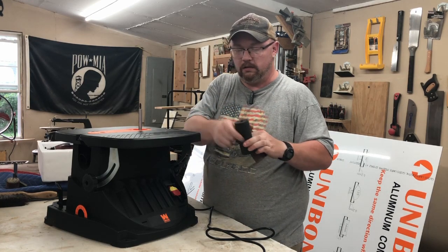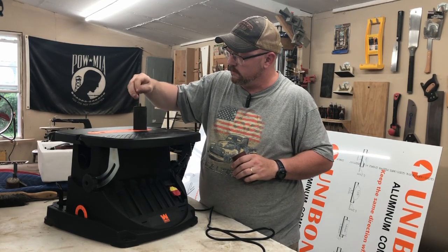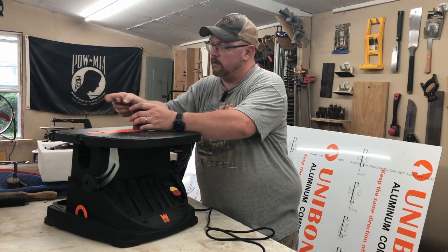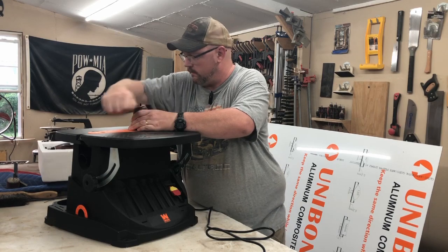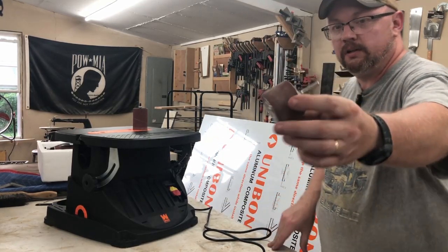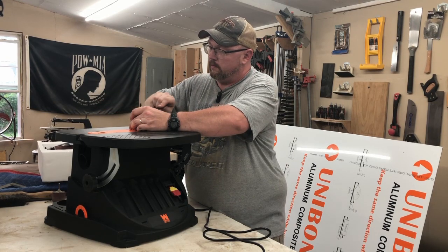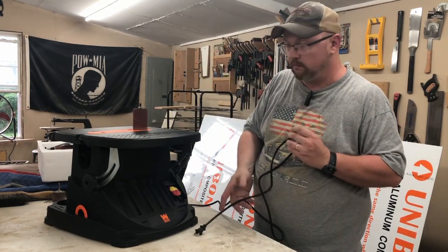So guys, we'll get right into the meat of it. I'm going to go ahead and install this large spindle insert here. And literally it just slides down on that shaft here. Use the large washer, followed by the nut. Then you take your sander sleeve, pop that on there. And I would say, make sure this thing's pretty snug. I mean, don't go crazy with it. What I used before this was not very good. You've seen these things, you chuck up in a drill, whatever, and it seemed like no matter how good we tightened those, this little sleeve would come off. And this one seems to stay on pretty secure. Like I said, you ain't gotta go crazy with it, but you want to put some good pressure on it. So we'll go ahead and get this thing plugged up and I'll show you how it works out.